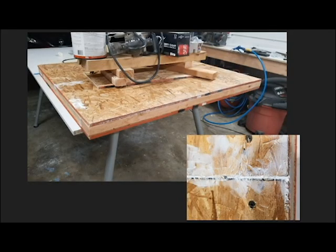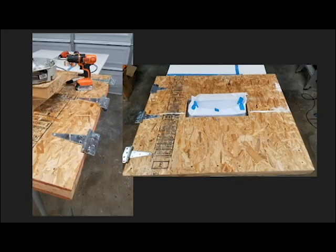I completed the door — it got insulation filled. Originally this was going to be drywalled, but drywall wasn't strong enough to hold the hinges. So it's sandwiched in half inch OSB, and all the seams were glued and sealed up tight. The door is one heavy beast but it's rock solid.